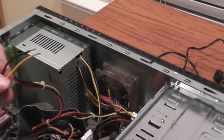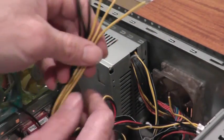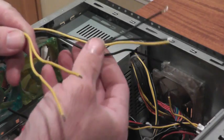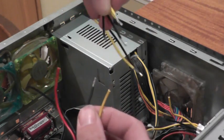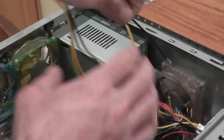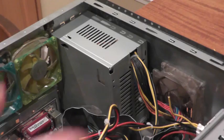So I will just cut the yellow and black wires and strip them. Now it's just a matter of connecting everything. I've also stripped all of the wires on my PCIe plug. The way I'm going to put this all together is: I'm going to tie together two of these yellows and two of these blacks, and that's going to go to this yellow and this black. And this yellow and this black are going to go over here to this other connector. I can connect these in a few different ways — twist and tape, wire nuts, or butt connectors — but I'm going to solder them.